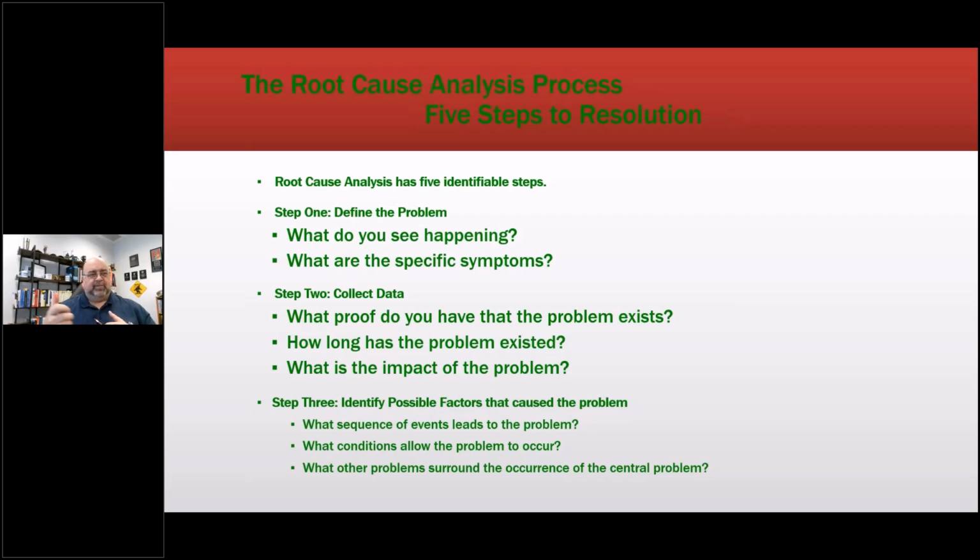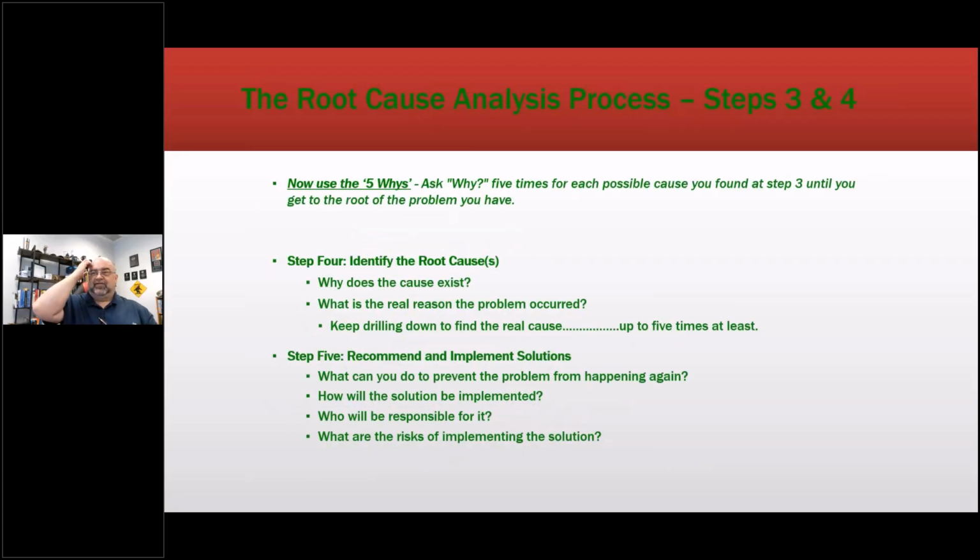Oh, so we started to look at the ground ties and we collected data, and then we traced it all the way back up to the machines that were seeing the high rate of failures and discovered that the harmonics they were putting off into ground next door at a very high frequency were traveling into the other plant and were circulating currents. So that was the end of the 5 Whys.